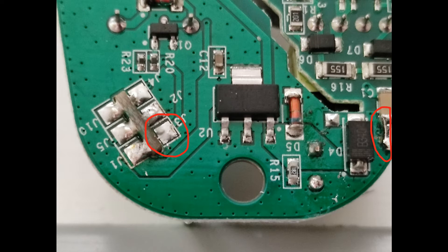So let's investigate those. At this point we could just do a quick repair — touch that pad up, get rid of that mess on the right-hand side. But that's all on the ground plane anyway, just untidy, not really critical. But there's no fun in that, so let's do a bit more investigation.